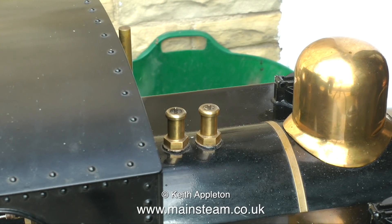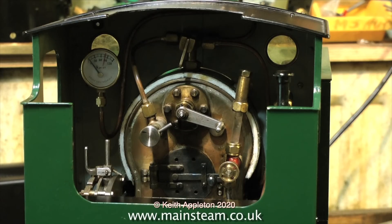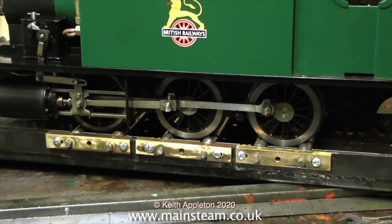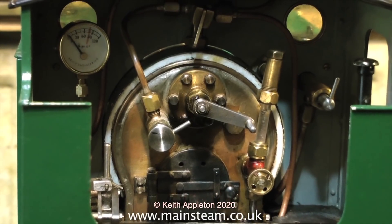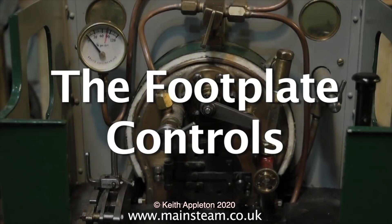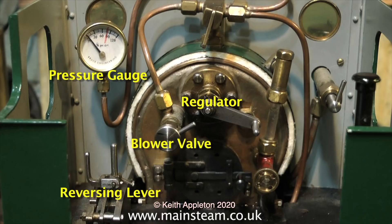The injectors worked perfectly every time. The first ever live steam locomotive I had, apart from a Stevenson's Rocket, was one of these — a Rob Roy in three and a half inch gauge. A lot of these are built by beginners, but I'm not happy about that. It's more like watchmaking: all the parts are very small, the finished engine is quite small, and the fire can be difficult to keep alight, especially for a beginner who hasn't mastered the art of keeping a very small coal fire lit. You have to remove the roof to drive it, and I never did like that idea. This footage is from a feature I made about this Rob Roy just before I sold it, showing the names of the controls.